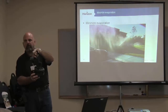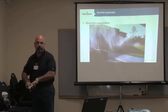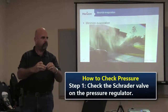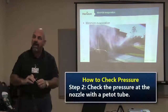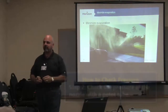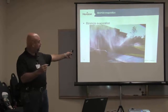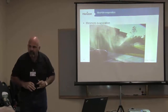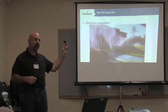Screw this device in — this is your dial regulator. It's called a PRS dial, a pressure-regulating stem. That's Rainbird's pressure regulation device. It's got a little Schrader valve on the backside so you can check that the pressure reading on the dial matches what you're actually getting. Better than that, take your pitot tube and go out to the nozzle and check what the pressure is there, because that's where we want the pressure to be. We may be at 50 PSI at the valve, but 45 at the nozzle — and that's perfect. That's how we get the most efficient system, with water going out in proper droplet size and not evaporating.